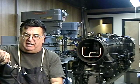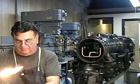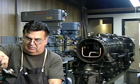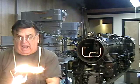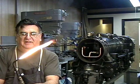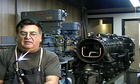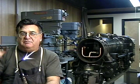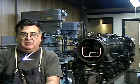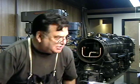Alright, I'm going to light it up. Always turn it away from yourself so you don't burn yourself. Turn on the gas, then turn on the oxygen. You want a very small flame — you don't need a lot on this because we're doing something very thin. It just takes practice, that's all there is to it. I hold the solder in my right hand and the torch in my left hand.